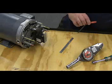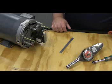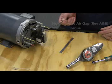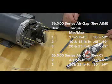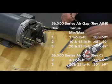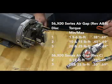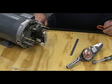If the application is vertical and/or ceiling or wall mount, the plunger may naturally drift from its true gap position, not having the benefit of gravity to hold the true position. In any of these configurations, you will need to manually push the plunger toward the coil frame just until you feel the tension or resistance of the pressure springs, then check the air gap. Looking at this example, we can see that the air gap needs to be adjusted.